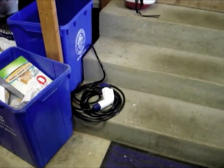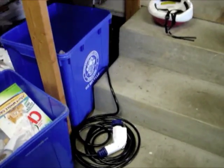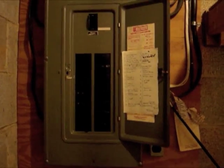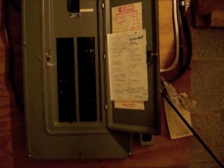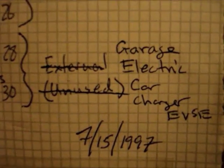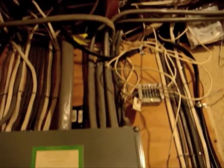Here's what I was using — the car trickle charger, I call it Level 1. I don't have to use that anymore, so I'll unplug it from here. This will go back in the trunk of the car for opportunity charging. The panel is now set up to handle my EVSE. We used the bottom breaker, which was unused, and it's now labeled 'garage electric car charger EVSE' on the last two breakers — which happened to be a 40 amp breaker. The cable goes up and turns to the left and then goes out to the garage.